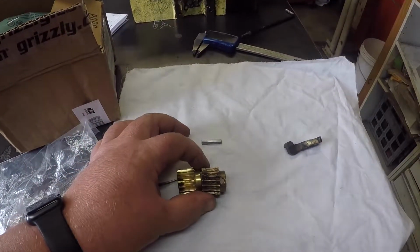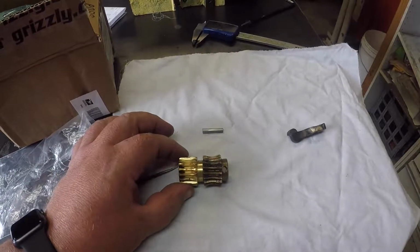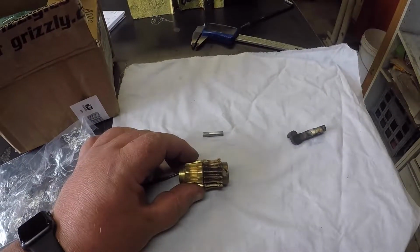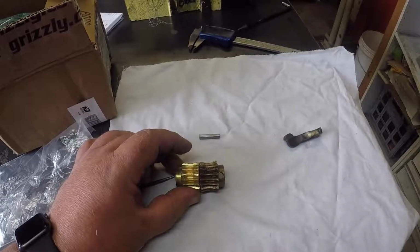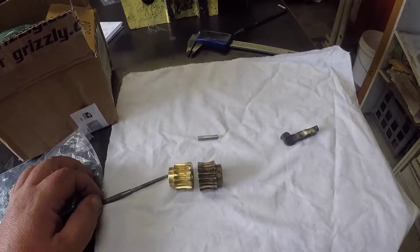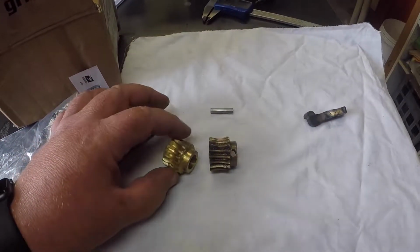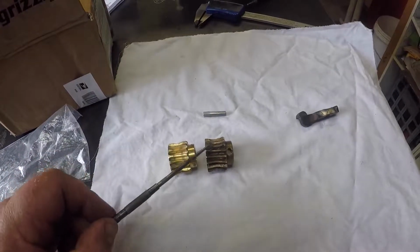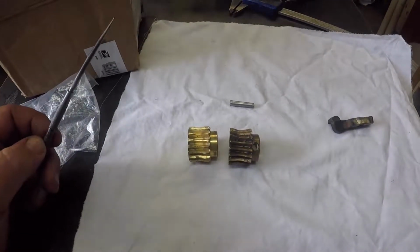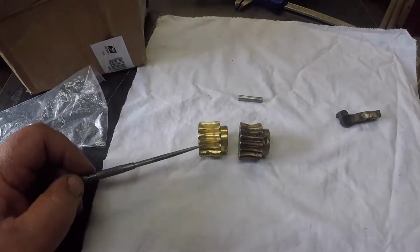I've shown a friend who is an engineer here and does a lot of machining work. He seems to think you have as much chance as anything of getting it to work. The teeth line up and look to be a perfect match, and the concave is slightly greater in the first one, but is it from wear? I don't know. I actually think they're both Grizzly worm gears. I believe the original one, this one, was replaced by someone at some stage, and the same thing was done. So it's off a Grizzly 9249, and it's a helical worm gear.